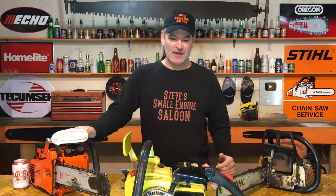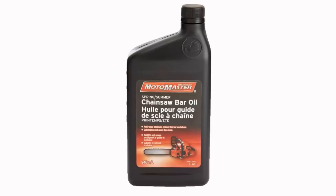Say if you have a chainsaw and you're using it in the summertime — you get summertime chain oil, which might say 'heavy' on it. That's okay because it's warm out and the oil is thick but it pumps through your oiler fine. But then the temperature drops in the wintertime and the chain oil starts getting thicker and thicker. It's already thick to begin with, now it's even thicker — sometimes literally as thick as molasses — and your chainsaw may not be capable of pumping it through.